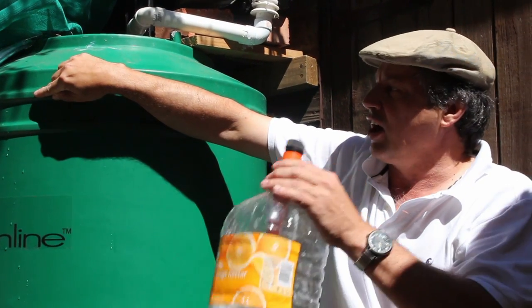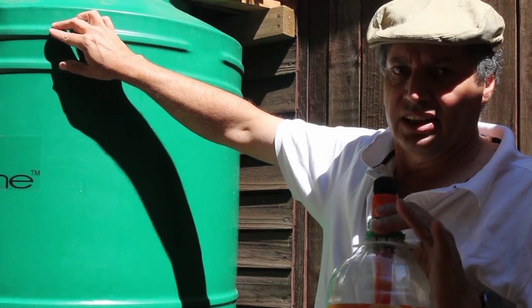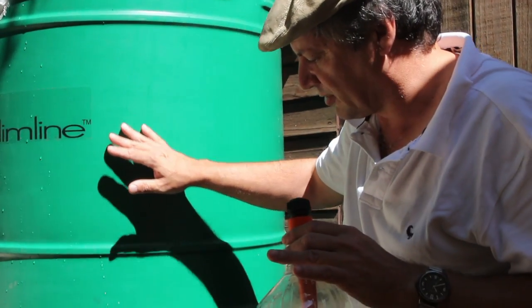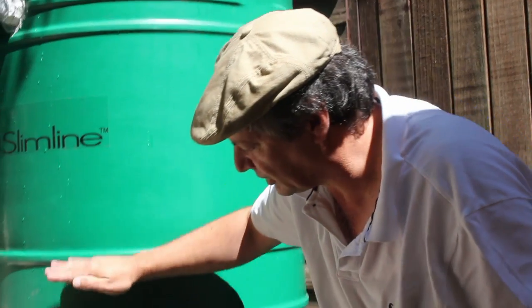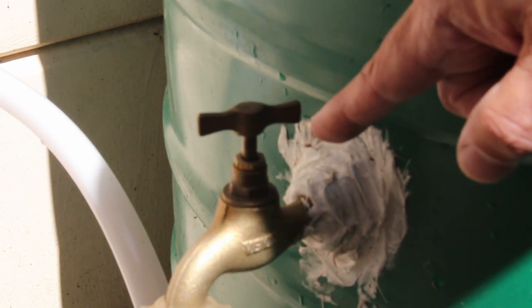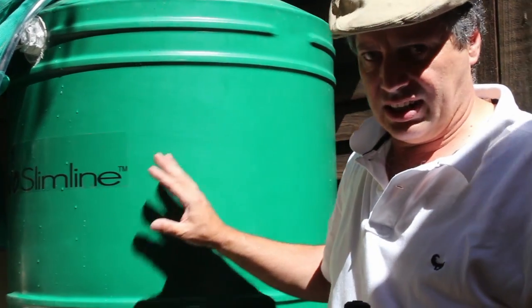When it's reached the outlet, you stop your pump and take note of how long it actually took to fill up on spray. The secret is to leave it for 24 hours — longer is even better. Then you will find that the iron and the manganese will start to settle out at the bottom. Then you can fit the fitting into the step and connect it directly to your swimming pool. Open the tap and you will have the clear water going down and out into the swimming pool. It's a good idea to take this handle off the tap here so that small children can't come and think this is drinking water, because remember this water is chlorinated water — that is what takes out the iron and manganese.